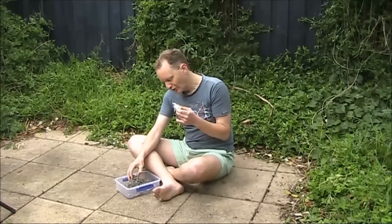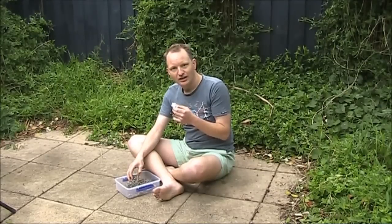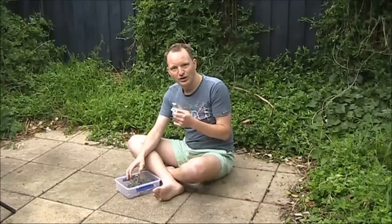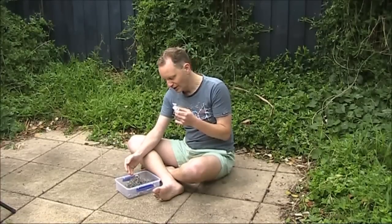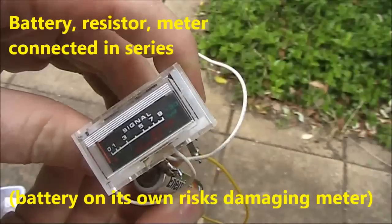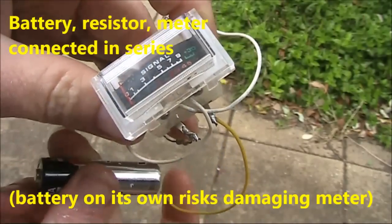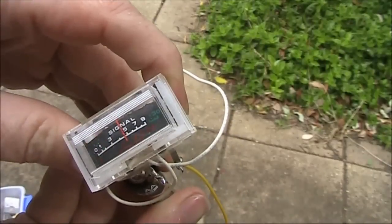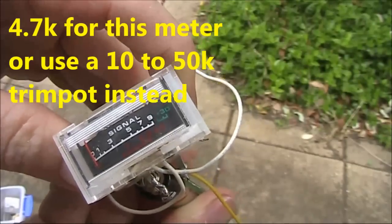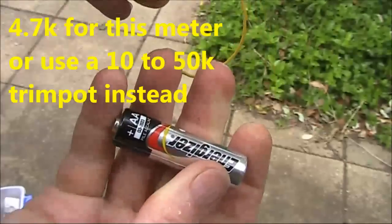Get a 1.5V battery and your meter movement. Have a look through the resistors, identifying ones that are between about 1K and 10K. You'll notice those because they'll have a red band as the third band on the resistor body, unless they're 1% resistors, in which case they may have 5 bands and are often a bit harder to read. This is with the battery connected reverse across the meter — flip it around and get a forward reading. The optimum resistor value is where the meter needle deflects about half to two-thirds maximum on the scale with a 1.5V battery.